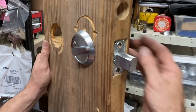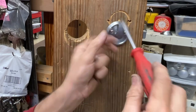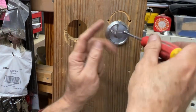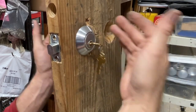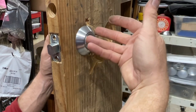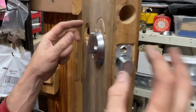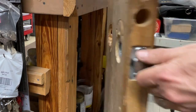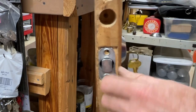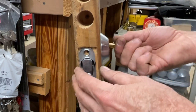Check what's happening — that tailpiece was too long and it's rubbing. If I tighten the face screws down, it's really going to be a problem. But when it's set up correctly, once you tighten those down it firms the deadbolt up on the door. You screw the cylinder as far as possible, back it off one turn, make sure it works, make sure the tailpiece is the right length, tighten down — that clamps it on the door. Then just put your plate over it.